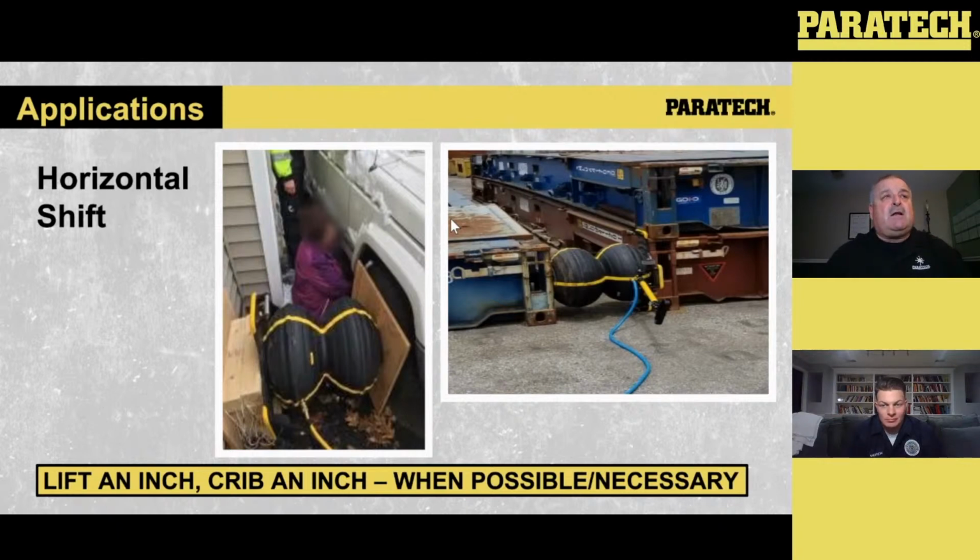It's called light rail, but the car weighs approximately just over 100,000 pounds, so just over 50 ton. So if you take a look at what Andrew was saying earlier about cutting up the segment in the vehicle to give you the load that you're going to lift with the equipment you've got. So you were looking at maybe about 15 ton because the cars were separated in 3 segments. We did the lift on each side of the car, took it up off of the rail.